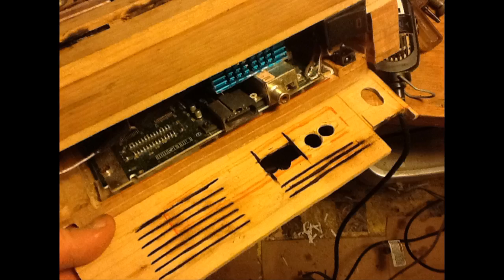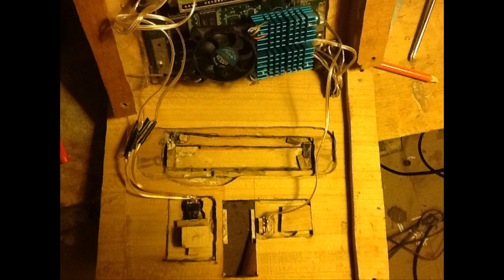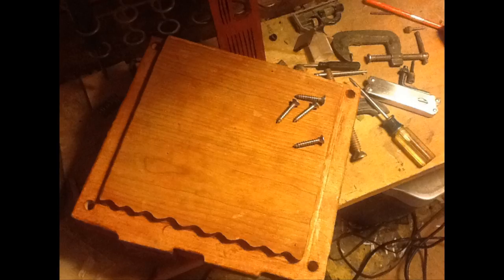Along with not having most of the parts of the Super Nintendo, I also did not have the power cable. My fix was desoldering the 12-volt line from a portable DVD player and putting that on the Super Nintendo. I beefed up the heatsink on the regulator — I put a Cooler Master heatsink and fan from a Pentium-1 processor on there, which means I now have a hard-wired switch on the back to cut everything off including the fan. With the regulator's new beefed-up cooling system, I can pretty much throw any power adapter between 9 and 20 volts on it with no negative consequences.